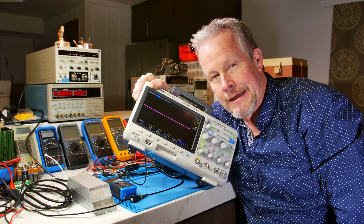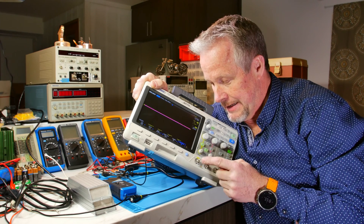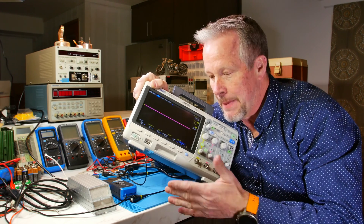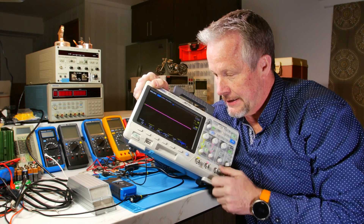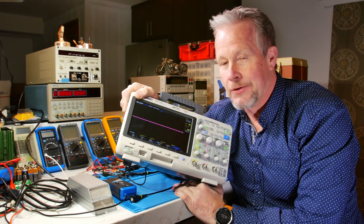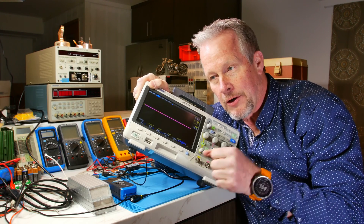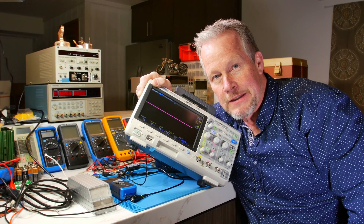Your circuit that you're troubleshooting — maybe it can only put out an amp. But now, if you're troubleshooting an AC circuit and you short this chassis to something hot on your circuit, maybe 115 volts, fireworks could happen, and that would really be scary. So don't do that. Be careful. Just be cognizant of that. Make sure you're careful where you're putting this ground. If you're not sure, unplug everything. Take your ohm meter and ohm your circuit out, and make sure the two places you want to put your ground straps to are the same potential.